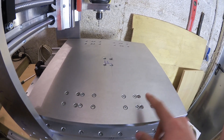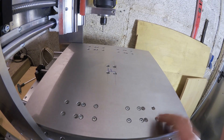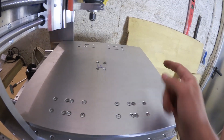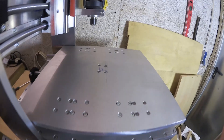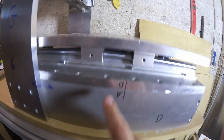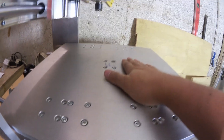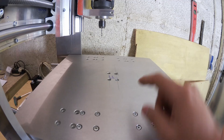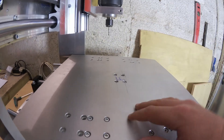Last, I want to mention this extra set of holes in the machine bed. I put those in since I haven't decided yet what I'd rather want — a 30cm really sturdy bed, or 40cm but with only 15cm in the middle fully supported. Depending on how much metal I actually machine, I will either leave it as is or change the bearing blocks to the other position.